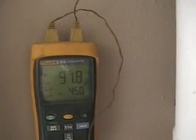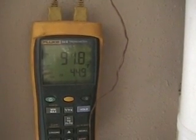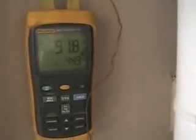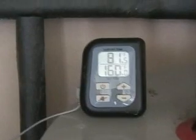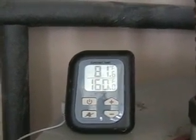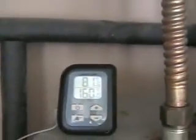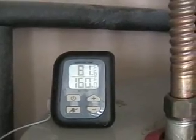There are a couple of thermometers here recording temperatures. The top number is the temperature of the water inside the 15-gallon tank, and the bottom number is the temperature of the water entering the refrigeration unit coming out of the ground. This other thermometer's top number is the water temperature coming out of the floor. You can see 91.8 degrees minus 81.6 is about a 10-degree temperature drop, so it's rejecting heat into the floor at roughly 10 degrees with the pump running at 1.2 gallons per minute.